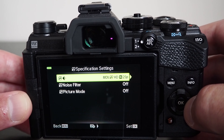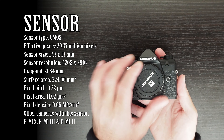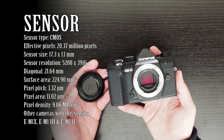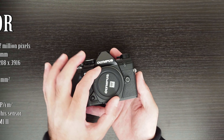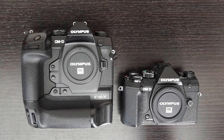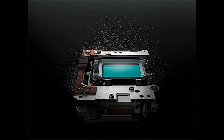The camera has a single SD card slot which supports UHS-II SD cards as well as older UHS-I SD cards — the previous version didn't support UHS-II. When purchasing or using an SD card, pay attention to its write speed, particularly for recording videos. DCI Cinema 4K video with IPB compression requires a maximum speed of approximately 237 megabits per second, within the range of U3 and V30 speed SD cards. 4K video with IPB compression requires about 102 megabits per second.